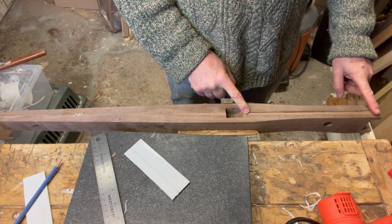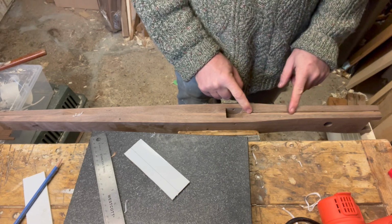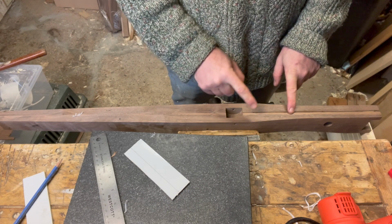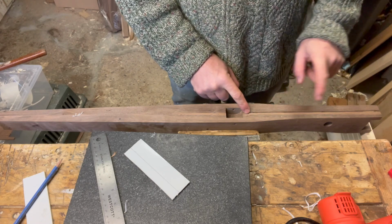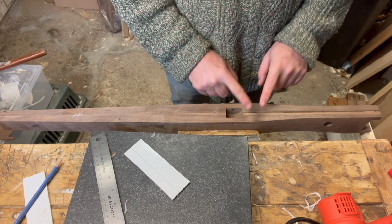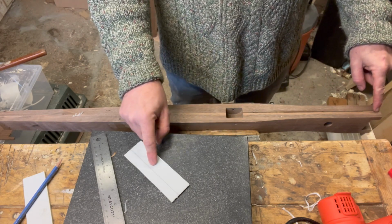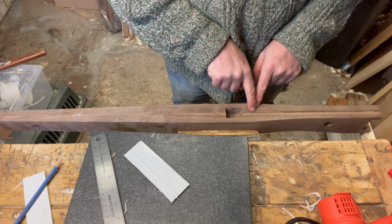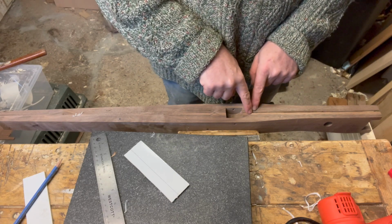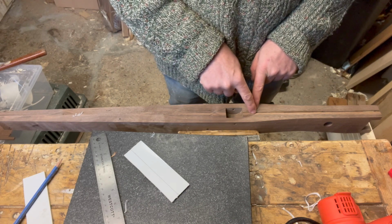or the bolt rest. But I just want to point that out, just because this groove is going to end up being gone. If you want to put the inlays in and then put a bolt groove on top, it's simply a question of, once the inlays are in, carving that groove in the inlays. The only problem you're really going to have is at this point here, because we're doing two triangles essentially meeting at a point, so you may want to leave that a little wider.